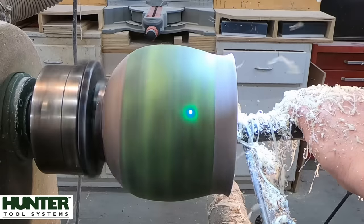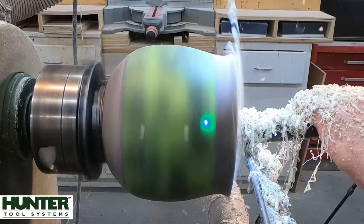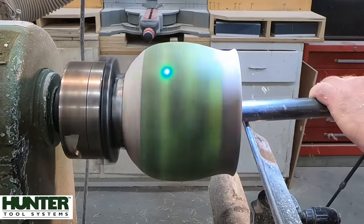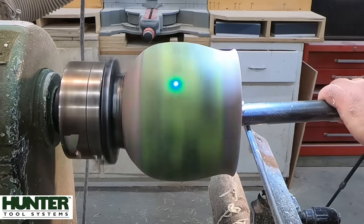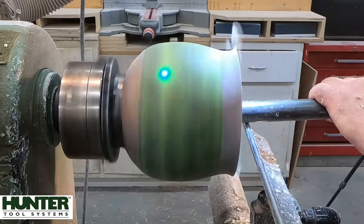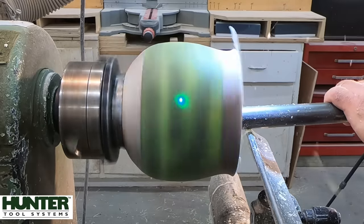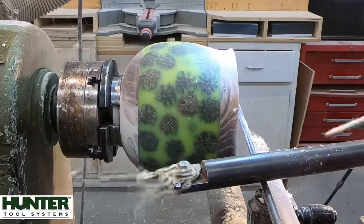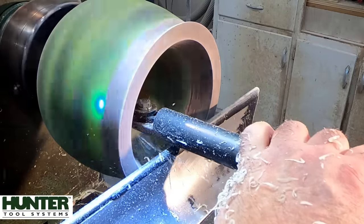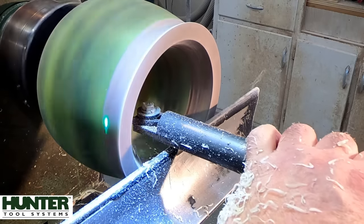The other thing I want you to take note of, when you look at the shavings coming out of this, is that it's cutting so cleanly that it was actually clogging up inside. So that's a great thing. You definitely want that. But remember to shut the lathe off regularly and get rid of those shavings, because what can happen is the boring bar itself can get caught up in it, and then it'll lift the boring bar and slam it back down on the tool rest.